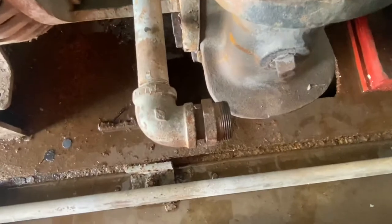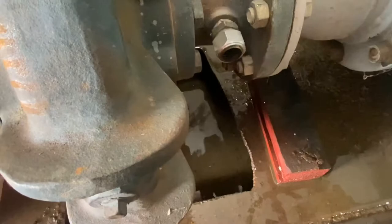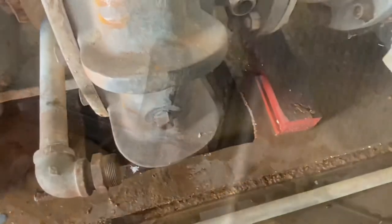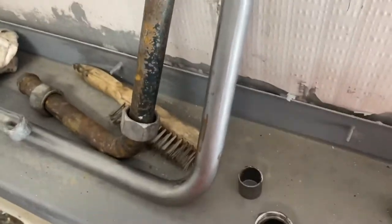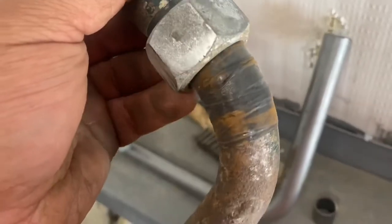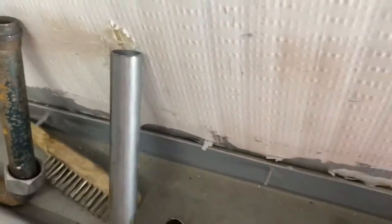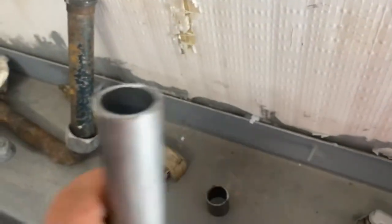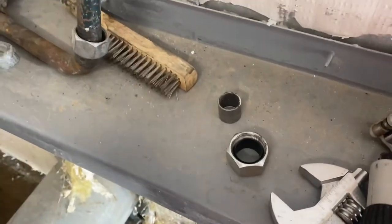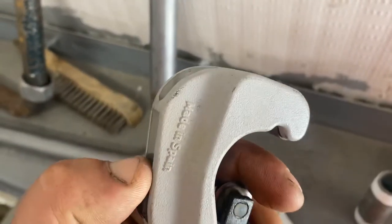You're going to have to get that old one out of there because I have a new one. I'm cutting the new one to size. As you can see, this is why I'm fixing it. Always — it's true of this kind of tubing, it's true of copper tubing — anytime you cut tubing with a pipe cutter, always deburr them.